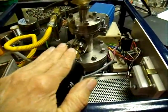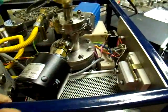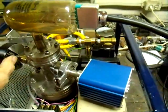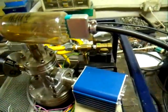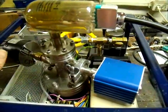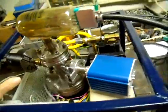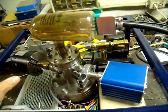We rough down through the turbo pump — it's a very simple approach. Since these things pump down very fast you can go from power-up to 10⁻⁵ Torr in about 30 minutes, comparable to a diffusion pump. If we want to do quickly changing experiments we'd need to add a high vacuum valve and a rough-down valve to isolate the turbo and keep it running while making changes. We may do that later, but right now this system is made for single-shot vacuum work — connect something, pull a vacuum, do something, then shut it down. It's not made for continuous batch processing where you remove and replace items repeatedly in short periods.